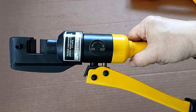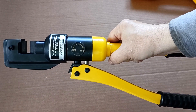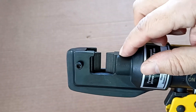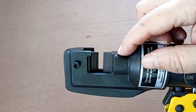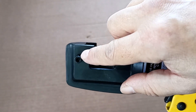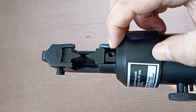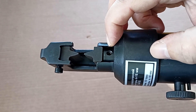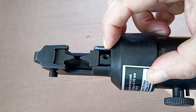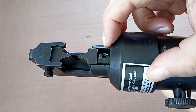I've already used this cutter a little — I tested it before filming, and now I will show how it works on video. Here are the rebar cutter knives. These knives can be replaced as they wear out. The upper knife is unscrewed with this screw using a hex key, and the lower knife unscrews here — to access it, you need to lift the knife a little. You can order replacement knives from the same company where I purchased this rebar cutter; you will find a link in the description.